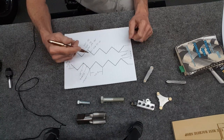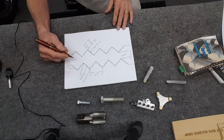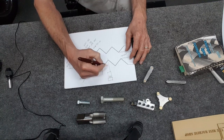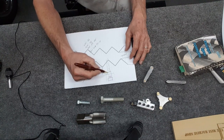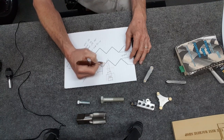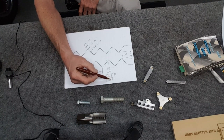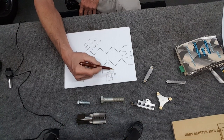But, okay, the reason why I got into this whole thing is because the second 3018 CNC is very old. It's an older model, and so the Z-axis lead screw was off. You had the motor and the motor shaft and the coupling, and then the lead screw comes down here. But the coupling, I'm drawing it wrong, was further down than the plastic piece here, so I couldn't bring this part up enough to hit the limit switch. It turned out the shaft was way too long, so I got the motor off and cut the shaft. Now the coupling is way up here. It clears this, so now I can go all the way up.